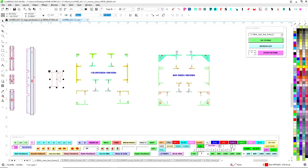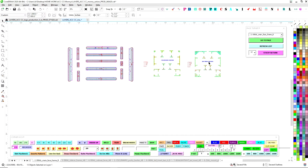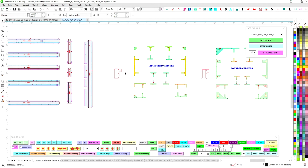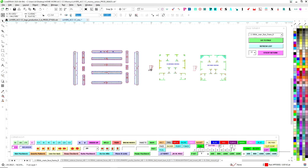And what I like to do here is just keep this to let them know that this is face up. So this right here just stays off to the side, and it lets anyone who's looking know that this has not been flipped or mirrored, so it's face down. This is all face up. And it helps when you go to assemble it. You know that this jig here with this 1 and this B faces this way, towards you. So that helps. And then same thing here. For the most part, these are all being routed face up. There's nothing here that's face down.